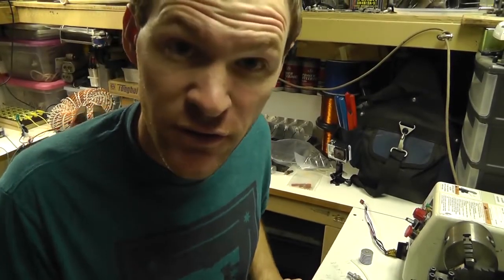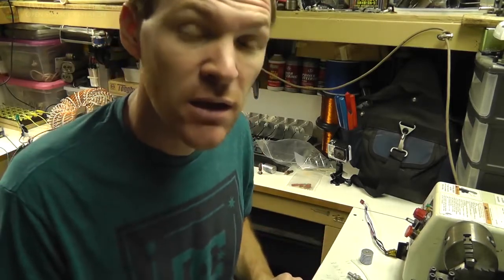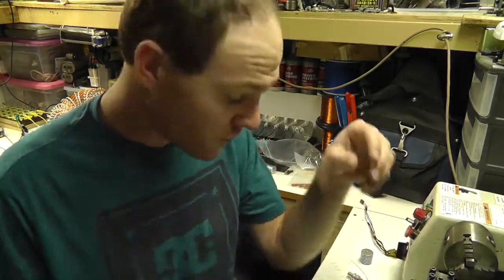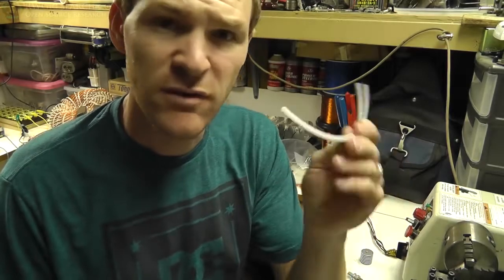Hey, what's up everybody? Russ with rwgresearch.com here. Today, this video is about making a Hotend. So currently I'm working on the OSD, and I'm going to be making some of my own Hotends anyway. So I thought I'm going to remake the one on my current printer. It's giving me fits. It's just the regular heating block with the like 10 watt or 5 watt heater with a thermistor through it, and it's really annoying. It drives me nuts. So I modified it already with a liner of PTFE like this, and it seems to be working okay, but it's still giving me fits.